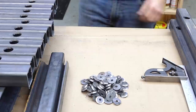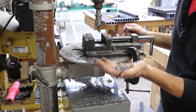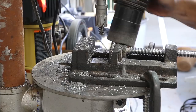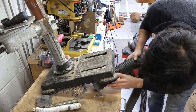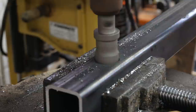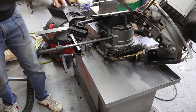All the holes are drilled. Before moving everything outside to start welding, I'm going to clean things up first. The nice thing about this annular cutter is it makes really small shavings, so cleanup is easy — I can just vacuum everything up with a shop vac, no different than wood chips. I've also stopped using oil when drilling mild steel because it makes cleanup so much easier; the chips don't stick or clump. It honestly doesn't seem to make much difference with the carbide teeth — it doesn't really need it for mild steel.